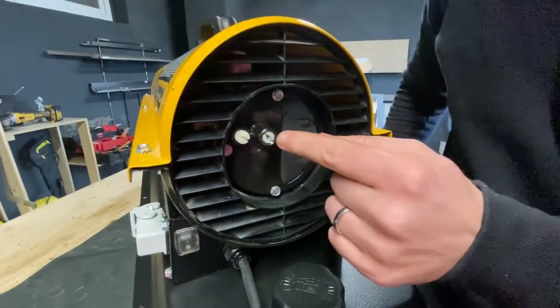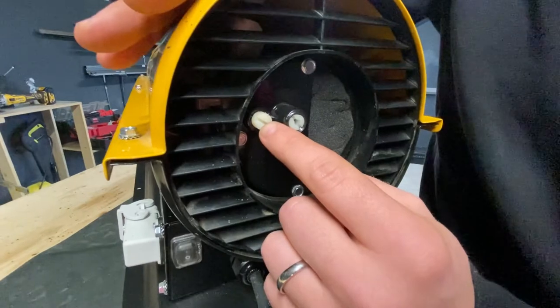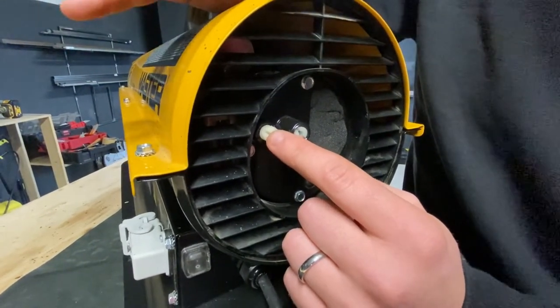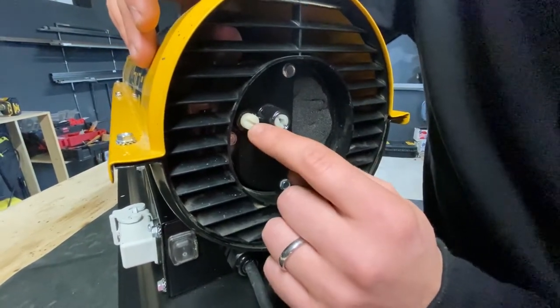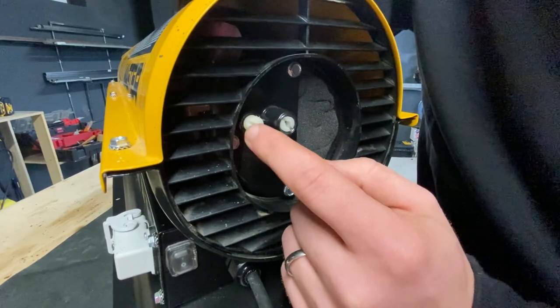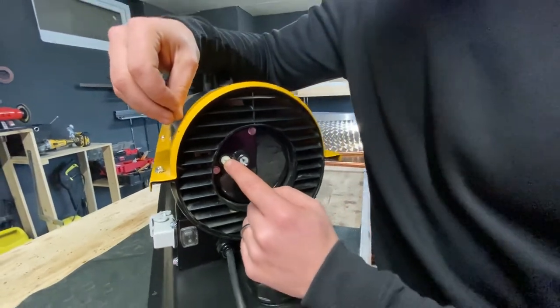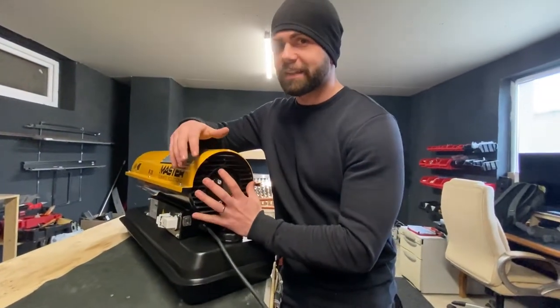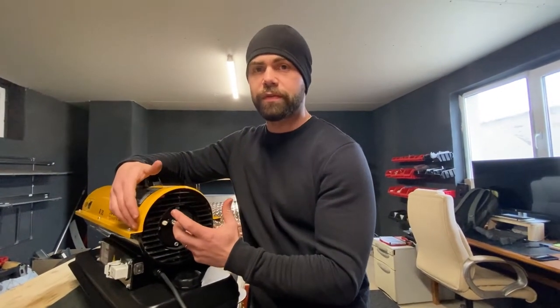Let's start from the left side. The way this unit works is that it will burn 100% of the gases. To do that it needs to work at the correct pressure. There's a screw that you unscrew and put a pressure gauge on, and that's the screw you use to regulate the pressure based on what the manual says for your specific unit. It's very important that the pressure is exactly what they recommend, otherwise you won't burn 100% of those fumes. There's always a risk of incomplete combustion, but if you keep it at the correct pressure the risk is way lower.